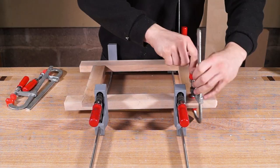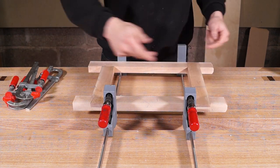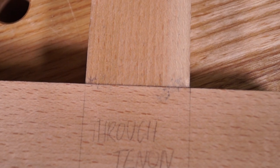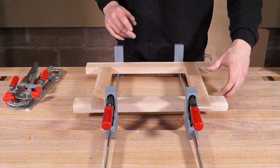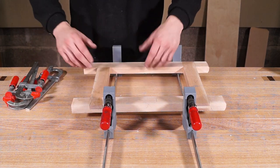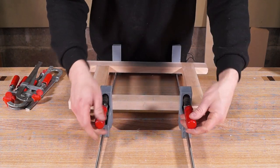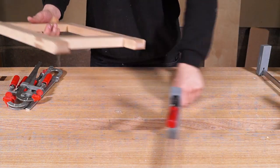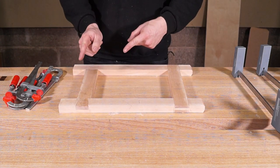Getting the clamps off — I think I should have put some parallel clamps in the middle and on these edges too, because on the mortise joint here it's not quite as tight as I'd like. A cramp there and there would have been better. Just don't over-tighten them; these sections can't take as much stress. More clamps the better. There we go — the frame is together. Let's get it upright in the vice and clean it up.